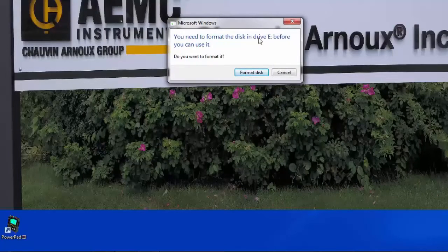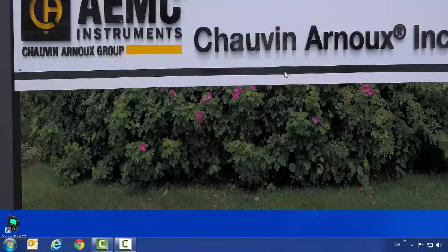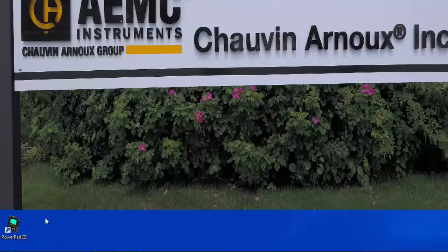Do you want to format it? The answer is definitely no. So definitely cancel. But try to remember the name of the letter of the drive before you do that, though. So it's drive E, and I hit cancel now. So we have two steps to try to prevent loss of data. One is we put the write protect tab, and the other one is we say cancel. So both prevent the card from being overwritten.